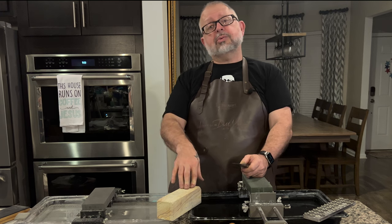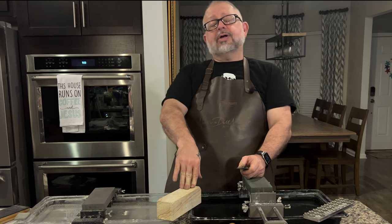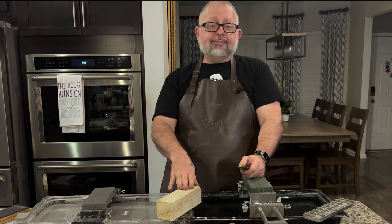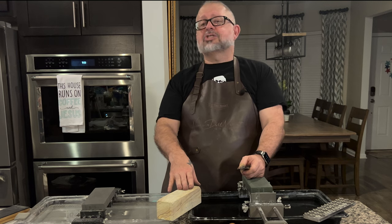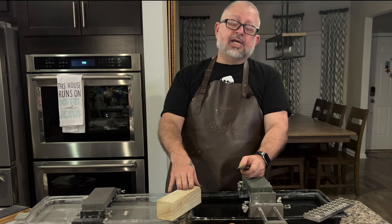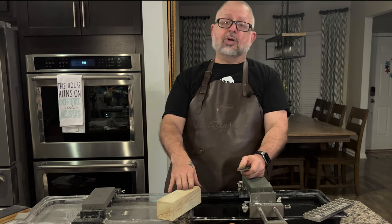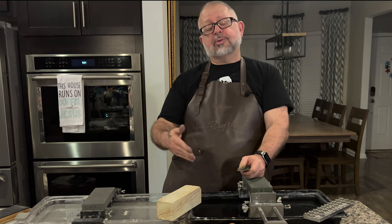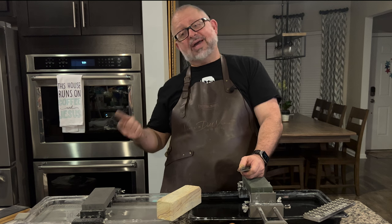I wanted to share the different solutions I have for this. First, something that makes sense when you're doing your own knives: try sharpening the opposite side first. If you start on your left side when it's dull, you'll do a certain number of strokes to grind that side, then when you flip it over, you'll sharpen less — but remember you already did the heavy grind on the right side first.